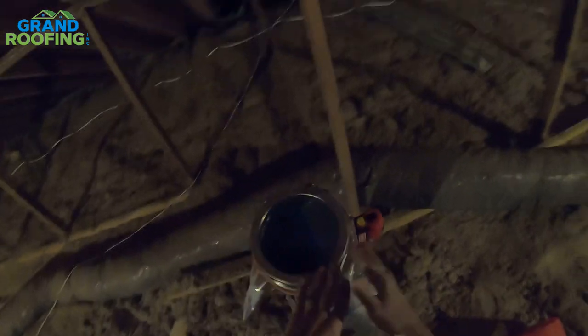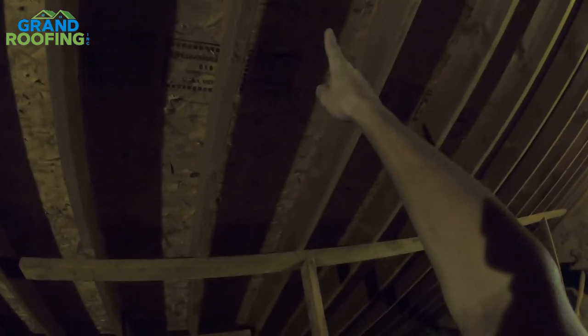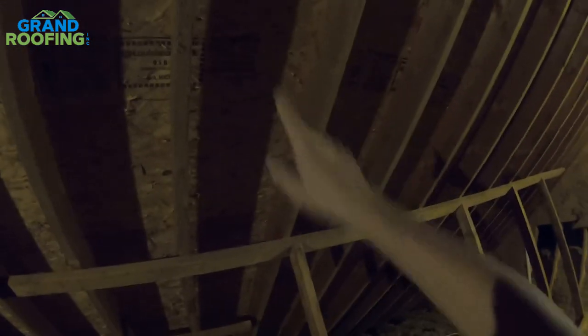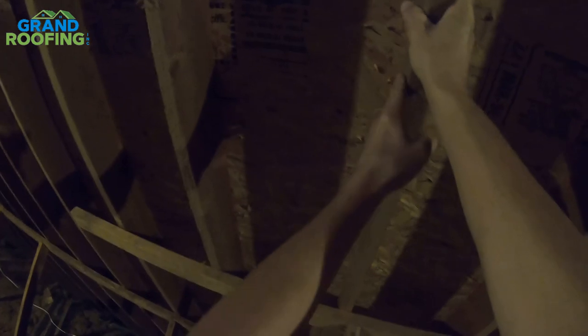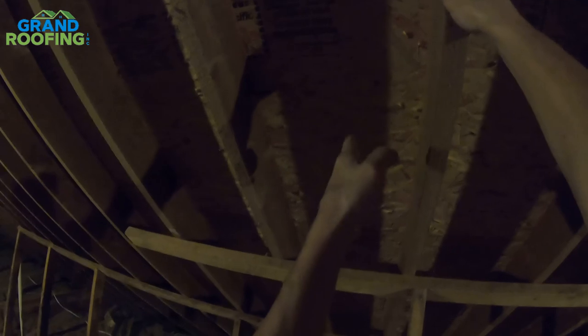There are several methods you could use to mark where you need to get through the roof. You can take a plumb bob, put it up on your roof deck, move it around until it's down the center, and drive your nail through that location. Looks like he's got a laser from straightening this up and shooting it to find clearance. He said it was a two-inch clearance from the combustible, so we need to get our edge out to here, kind of centered between this chase. However you want to do it, you just want your pipe to be finished through the roof pretty straight.